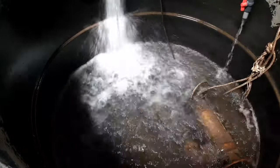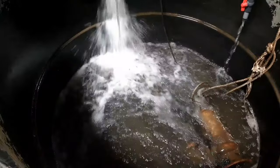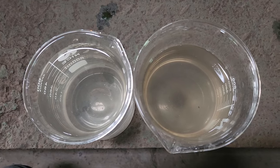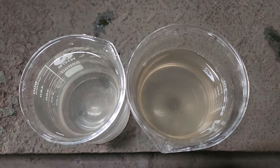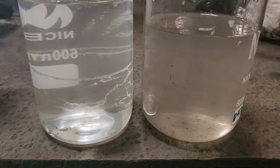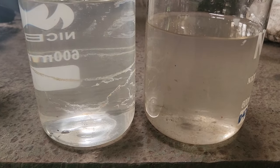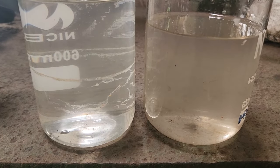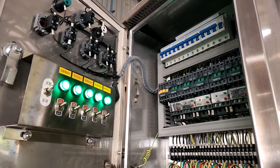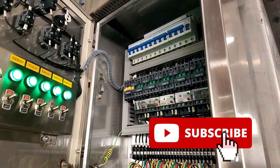In this example we also added some polymer coagulant to help coagulate some of the solids, which is commonly used in DAF systems but not so common in aquaculture systems. Here are some results after running this DAF system. The water on the left is coming out from the DAF system, and the water on the right is what the initial water looked like before the process started. You can see we cleared up a lot of organic solids and larger particles such as tree roots, which are commonly found in pond setups. If you like this content, do remember to like and subscribe as we cover more of these technologies that will help you in your aquaculture journey, whether using a RAS system or a biofloc system. Stay tuned.